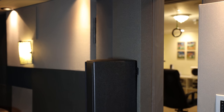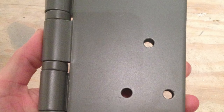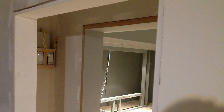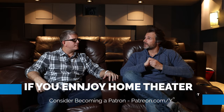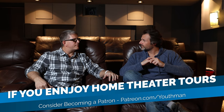The doors are an inch and three-quarter, and then we laminate another three-quarter inch MDF on top of that with green glue — you have to use a really heavy duty hinge for that. It's a double door system — an exterior door and interior door separating it from the rest of the house. It works well enough for what I need: to play a movie after the kids go to bed and have it sound like a little bit of thunder in their room, but they can sleep through it. That's two floors away.